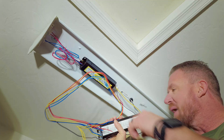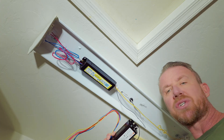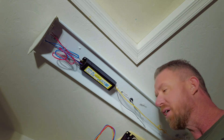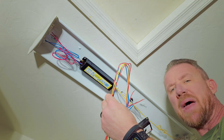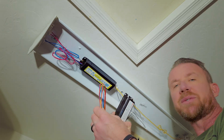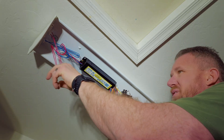As you can see on my new ballast, the wire lengths they give you are going to be way more than you need. It's built that way just in case you have a much longer fluorescent housing. In most cases around your home, it's going to be shorter — this is a four-foot housing. So what we'll have to do is snip off our wire lengths just to match where the old existing wire is at a good spot. Another thing you'll notice is on your direct replacement ballast, your wire colors are typically going to be the same, so you can cut these with confidence and just match your wire colors with your old wire colors.